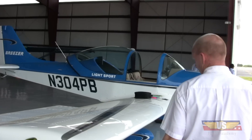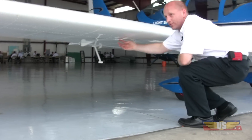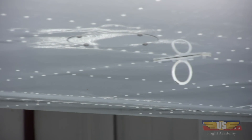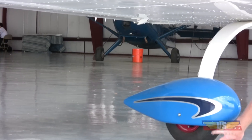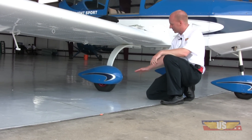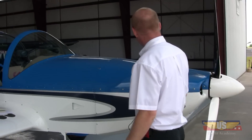Check the lights the same way. Get down underneath and look at the wing skin all the way across. We're also looking for access panels — a metal cutout with some screws — mostly making sure the screws are intact and still there. On the tires, check the wheel fairings to make sure they're attached and aren't cracked or broken. Make sure there's good tread on the tire, no split marks or obvious bald spots. I also look for brake fluid on the ground — if there's a leak in the brake system, fluid will pool underneath. Around any screws, make sure they're all in, tight, and secure.